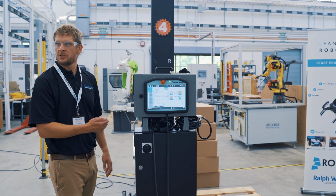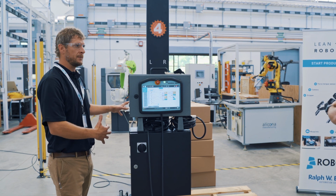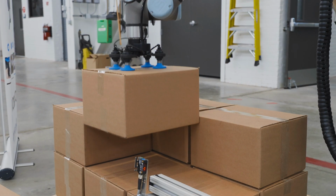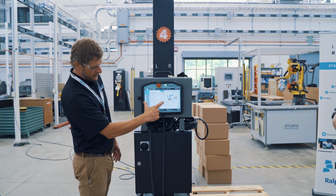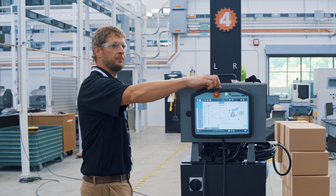This kit comes with software to create this palletizing routine that you don't even have to program the moves. You're just gonna walk through the step-by-step, pretty much instruction, and it's gonna start with box size. You type in the box dimensions, A, B, and C, box weight, right here, and then this is gonna set grip position. You're gonna set the position of the pick point of the box.